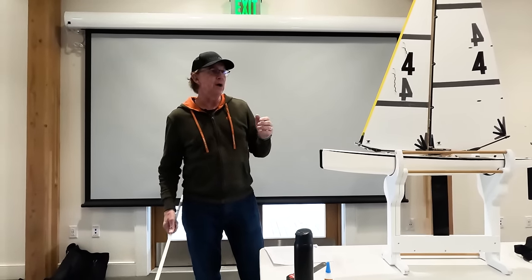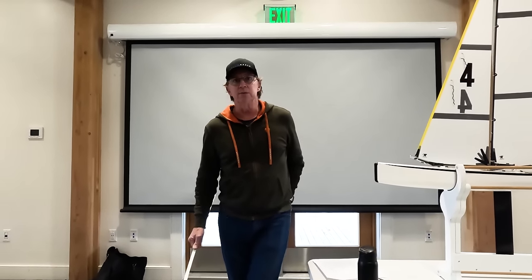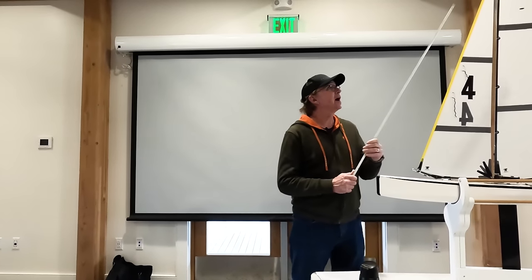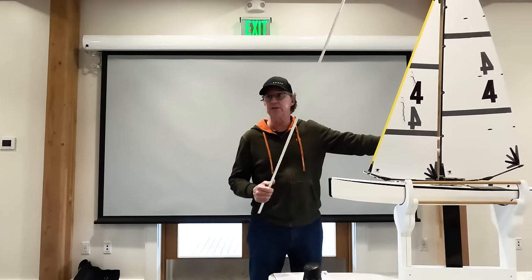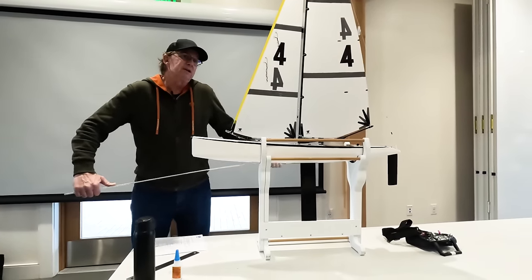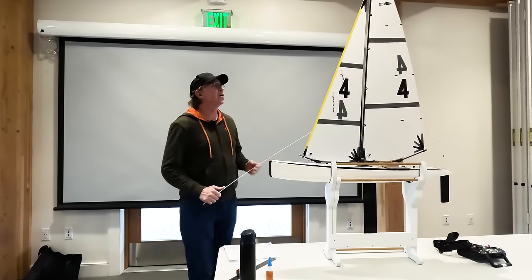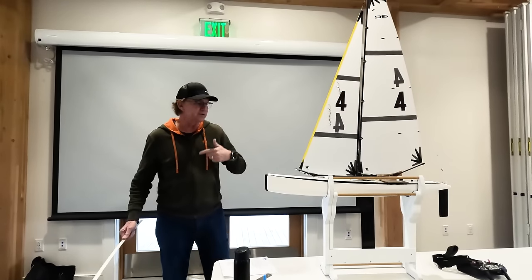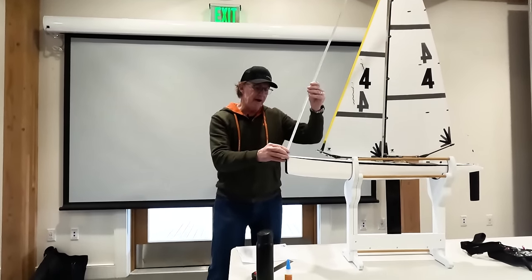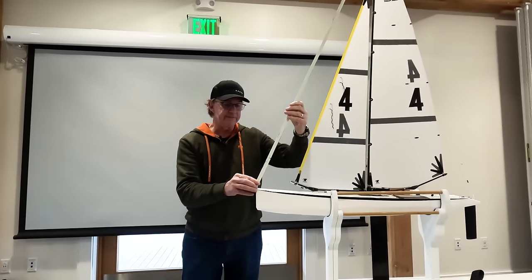I've changed my philosophy this past year. I read a really good article by, I believe, the current world champion, and he is convinced that keeping the backstay pretty close to the same all the time and adjusting your forestay is a little more efficient. So I decided, what the heck, I'm open-minded, as my wife will tell you. I'm super open-minded. So I started doing that this year, and I've turned into a bit of a hybrid of that concept. Let me explain. 1135 is what I consider my aft rake setting, center of the hole to the aft edge of the bumper.